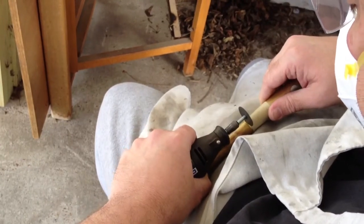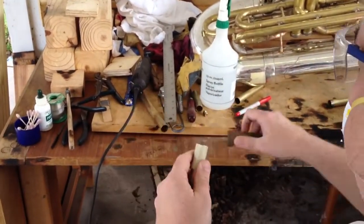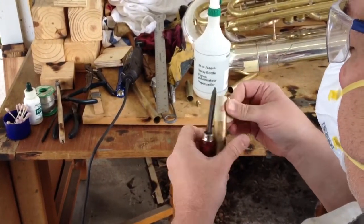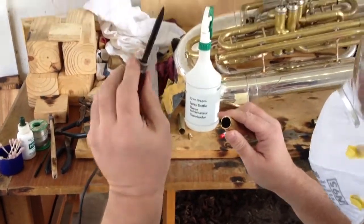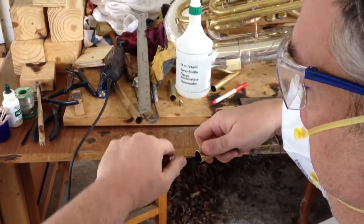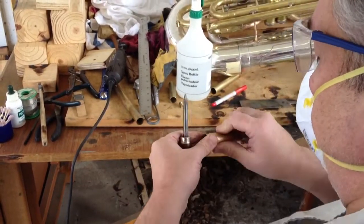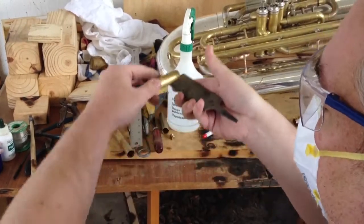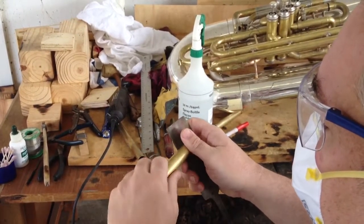I break through about an eighth of an inch at a time. Then I take a saxophone file — very wide, perfect for tuba tubing — to dress the end. I remove the tape. You can get this kind of stuff at Home Depot, some kind of material for cleaning soldering. I don't have tube dressers, so I use a triangular solder scraper. I set it inside the tube, cant it slightly out, and scrape all that garbage off. The outside will also have mushroomed out a little bit — a little ridge you can feel. If that's the inside tube, it won't go in if the ridge is there, so you always need to remove that.